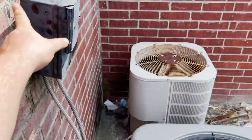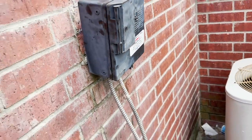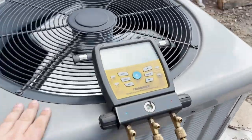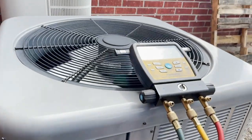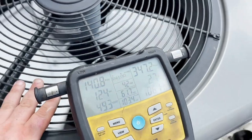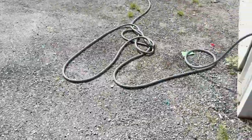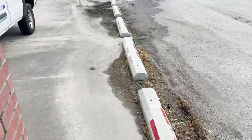I'm not leaving that disconnect box like that — that's just laziness on the installing contractor. My masonry bit is on the job with my installers, who are installing a condenser and coil this morning. I'm going to run to the electrical supply house or hardware store right here, grab a masonry bit, drill through that brick, and put an anchor in. You can see the subcooling coming up, so we're definitely on the right track.